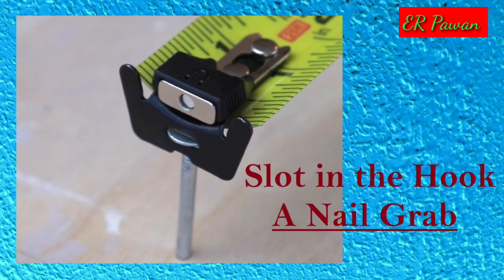Feature 4: Measuring a long span. When you need to measure a long span, it can be hard to tell if you have the tape straight, and just a slight angle can add inches to a measurement. The solution is to hook the far end, then sweep the near end up and down to find the point where the measurement is the shortest — that's your true measurement.